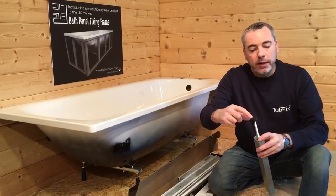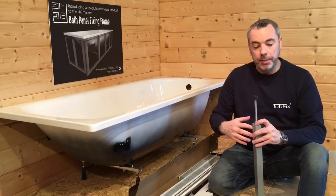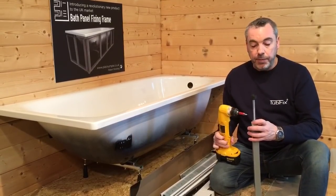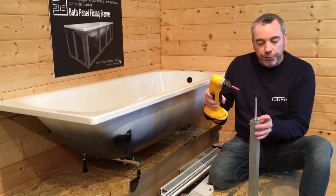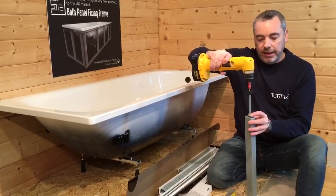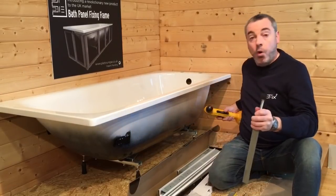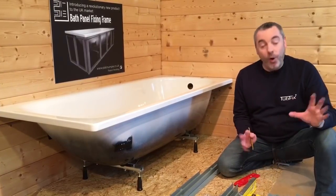In the top of the rubber you will see a Phillips indentation. This is purely here for speed purposes so that we can use an electric screwdriver with a Phillips bit and very quickly and easily screw down. A little tip: if you hold your finger on the flange nut when you screw your thread down, the flange nut will automatically stay in position. We're going to screw those down to the relative height of our bath, and do all four of them.